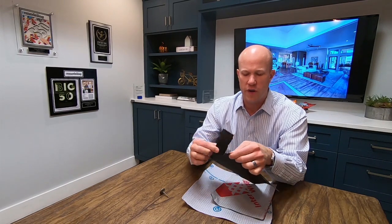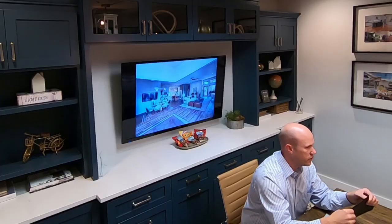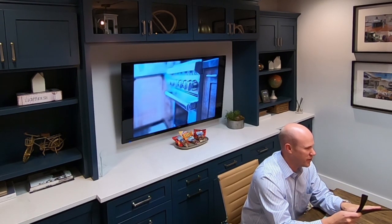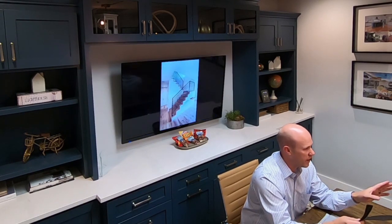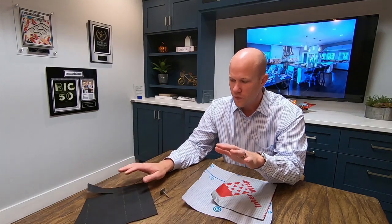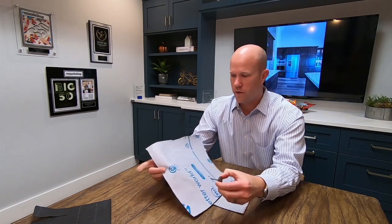I'll do a rip test and you can just see how easy it rips. It also dries out if it's in the sun — if someone waterproofed with this and then didn't get to the roof in time, it can actually dry out. You can only really leave this exposed for 30 to 60 days. That's not what we use. What we use is a combination — a synthetic underlayment. If I put that cap nail through it, it takes a lot more effort to get through, and if you try pulling it out, it grips a lot harder than the 15-pound.